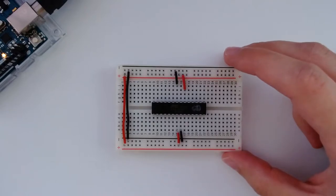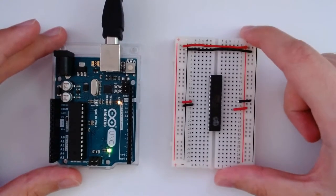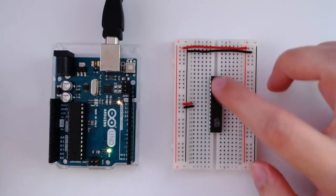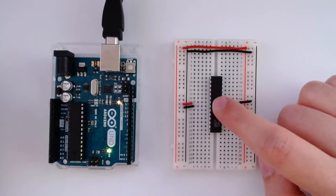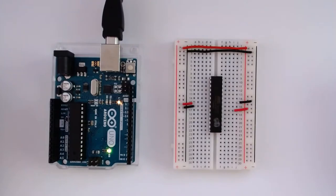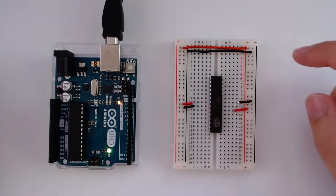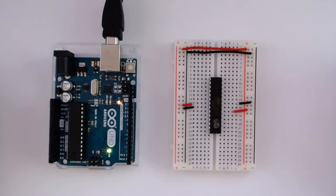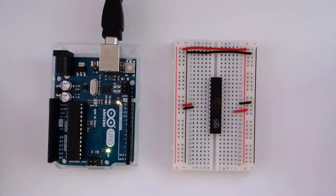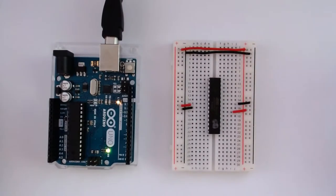Well, there's a little bit of a trade-off. The Arduino, or the ATmega chip, runs at 16 MHz. When you convert that to run on a breadboard using a 16 MHz oscillator, it runs at the same speed. However, a little-known fact about these chips is that they actually have an 8 MHz internal oscillator. So if you're willing to make the trade-off to run your applications at 8 MHz instead of 16 MHz, you can avoid putting in the oscillator circuit with the crystal and the two capacitors. The trick is that by default, chips that come with the Arduino have a bootloader set up to run with the 16 MHz clock. So in order to run it at 8 MHz, you actually have to burn a different bootloader.